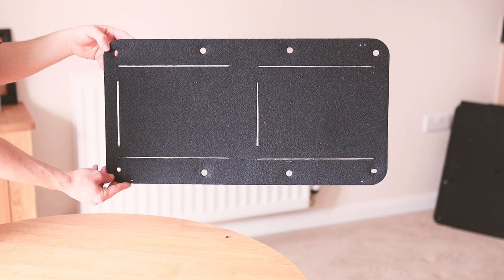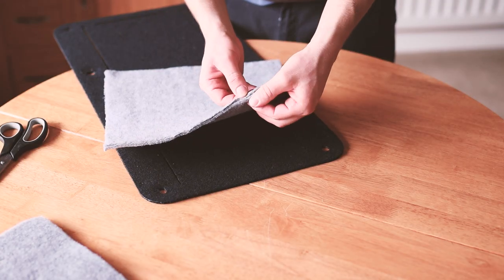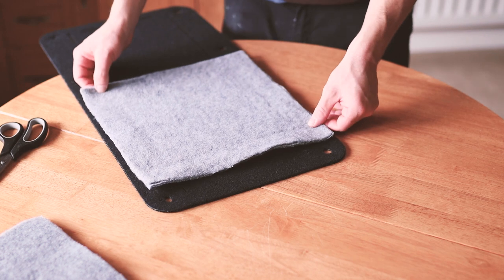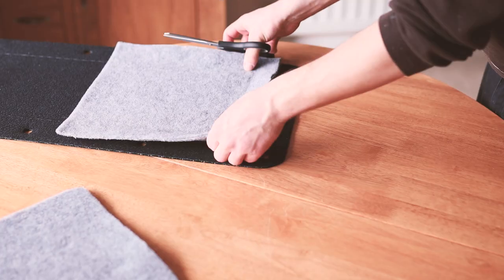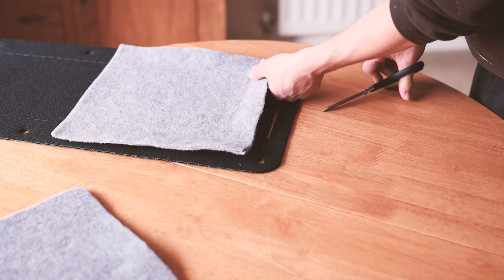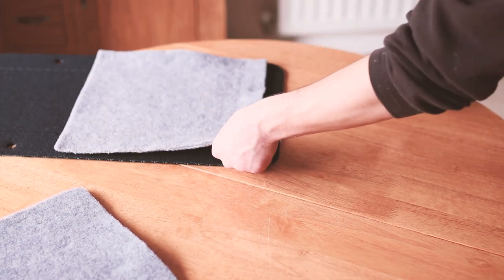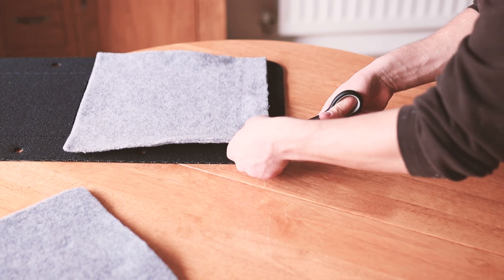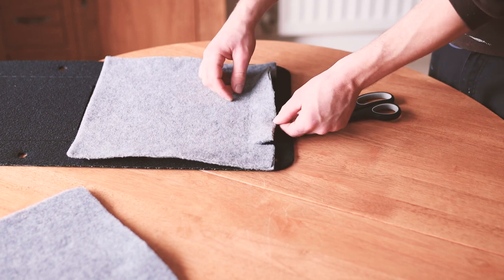After cutting these two sets of slots, it was time to attach the carpet to my panels. Making sure the glued edges of the carpet were going to be tucked into the back of the panel and leaving the neatly folded over edge on the front, I lined up the carpet against the panel and started cutting two incisions into each bottom corner. The first was 5cm in, the second was a further 2.5cm in. I repeated this on the other corner and then on the other piece of carpet. The purpose of these incisions is to ensure that the carpet can fit through the slits without getting caught or bunched up.